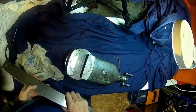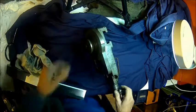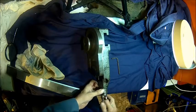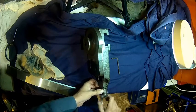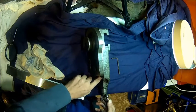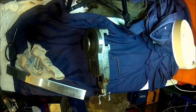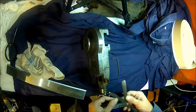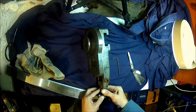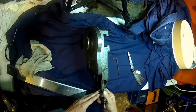So we're going to take the thing apart and probably put it on the shaper. Yeah, if I can avoid that play. I think the nut is not so bad actually. We still have, let's check that with a feeler gauge. So this screws out here. The collar.